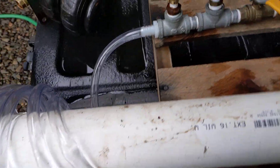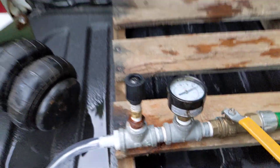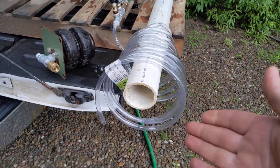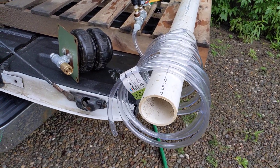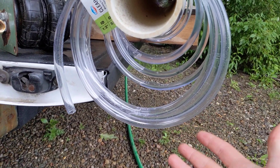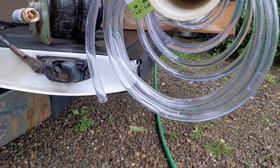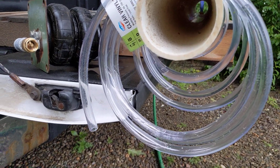This is just another proof of concept. I'm going to see how much water pressure we can get out of this at limited flow rates. I realize that's a limitation, but if you wanted higher flow rates just to prevent siphoning, you need larger pipe. You could even build this out of two-inch PVC pipe, and that would probably flow a lot of water — even a garden hose full of water would not be enough to create a siphon in two-inch pipe.